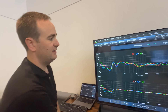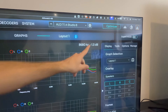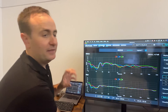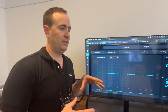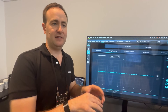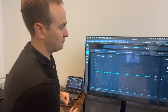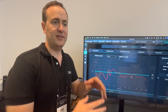A couple of nice things in here — we can do a crosshair. So you can see at 8,680 Hz down at minus 1.3 dB. Before and after, and then you've got all your overlays. Let's have a look at something I feel is really cool, which is the target curves. The way we've done the target curves now — previously you would have to go back to your graph data, have a look, make an adjustment, go back to target curves, back and forwards. What you can do now is overlay your frequency response from your speaker with the target curve.